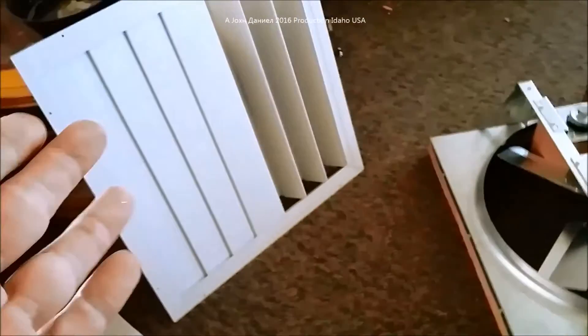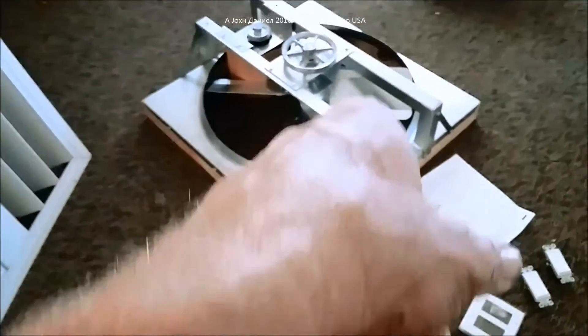The unit is just metal, so when you install it, make a small insulated panel with magnets epoxied or screwed in, along with a foam ring. You'll be able to stick that on during the winter time so you don't have to worry too much about air loss from your heating unit.